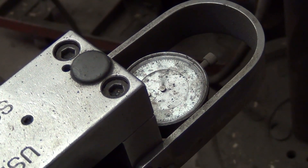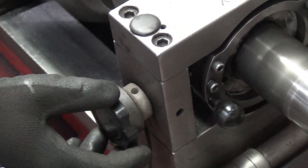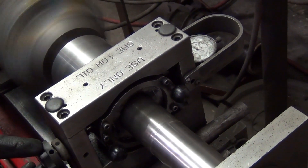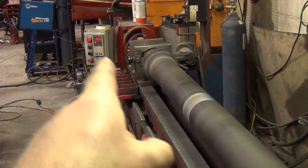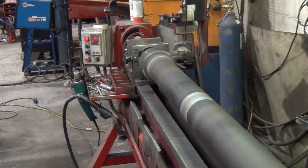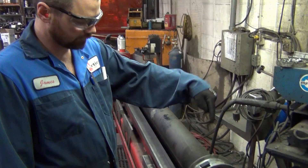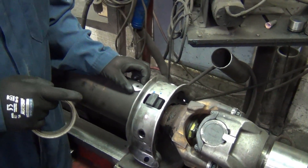This is a really good balance. I'm going to turn this knob, which slowly pushes a brass pin — a brass sensor — against the locking mechanism I unlocked earlier. I'll slowly turn this wheel until my light starts to respond. That's the green one — that's great. There's a pretty solid number two showing there. I'll back the sensor off. We had a green number two showing up, so I'm going to find two on this white dial, and that is where it's asking for weight at this end.